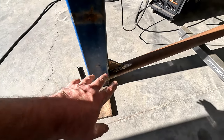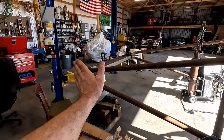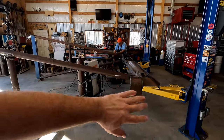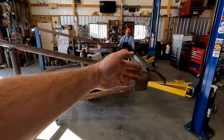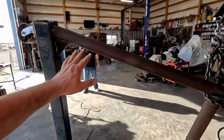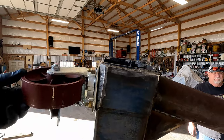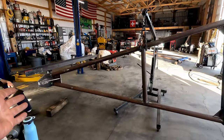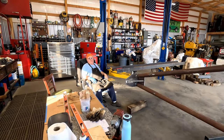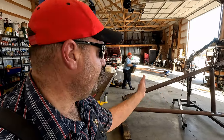I've welded part of this gusset on and I've got to finish it up — kind of giving my welder a break since it's been going pretty continuously. Dad and Butch are putting on the casters. We've got our gussets to put on the very top still. Just finished welding the gussets up here at the top — got those on there. Dad's grinding to put the one on the other side. I've got a lot more welding to do, but we're going to unbolt this leg and roll it over so I can weld the stuff on the other side. Got my welding pretty much done — a little more to do on these bottom gussets when we get this thing set up. We're done up top. Dad's cutting off these bolts — they're just a hair too long, so he's going to grind them off so they won't interfere. We were just admiring our engineering, how well balanced this is when you pick it with a crane. Dad calls it fantastic engineering, but in reality it's just lucky engineering.